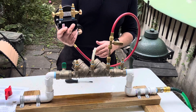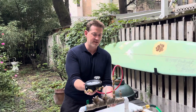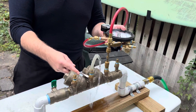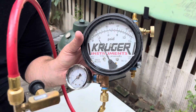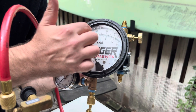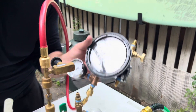Close shutoff two, close shutoff one. Make sure your test kit is level with the top of the clear hose. Hold them horizontally because your test port should also be level — everything should be level with the top of the clear hose. Now open test cock three to bleed off all the extra water. Your gauge is going to drop down to the reading — 2.6 is what I'm getting. The little tiny lines are 0.2 increments, the bigger lines are 1.0, so I'm reading about 2.5.